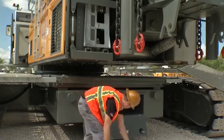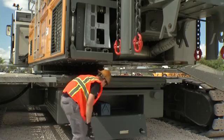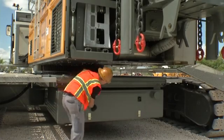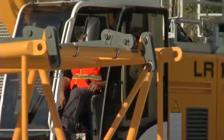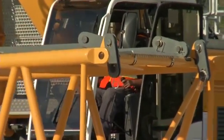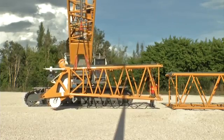Auxiliary devices, rigging material, and tools can be transported and stored in the storage compartments of the car body counterweights in order to save space. Generally, the boom sections are always assembled in the same way. Here, this process is shown on the basis of boom head assembly.